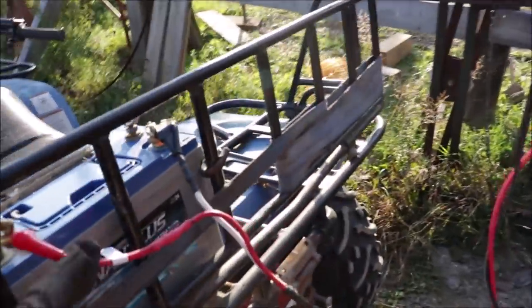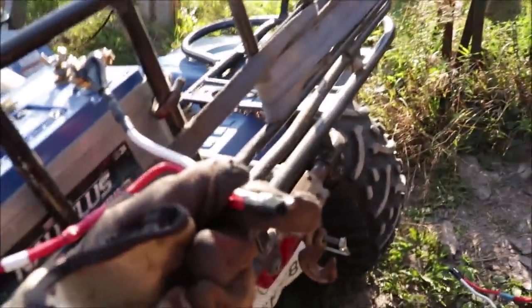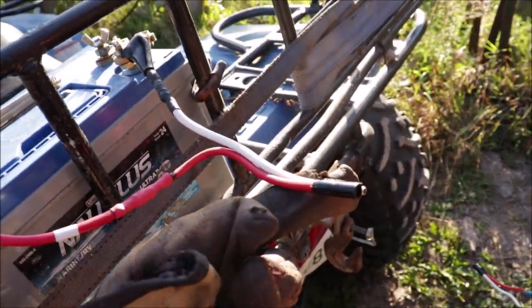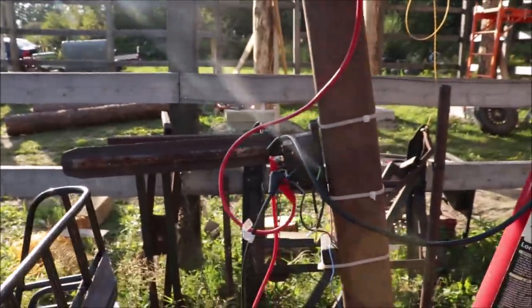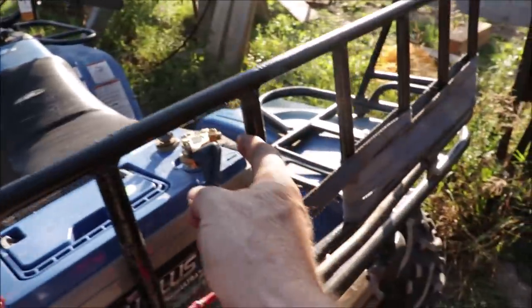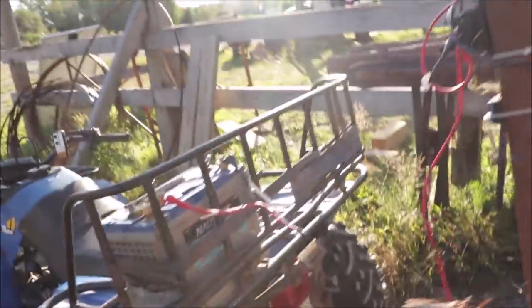And see the power wire here, this side I use the female end, so if it touches anything, it's not going to short out. This end here, the power is the male end, but it doesn't go anywhere. There's no power in that box, but there is power in that battery. So in case this cable ended up touching here somehow and the power touched here, boom, it's not gonna cause a short. It's a lot better now.